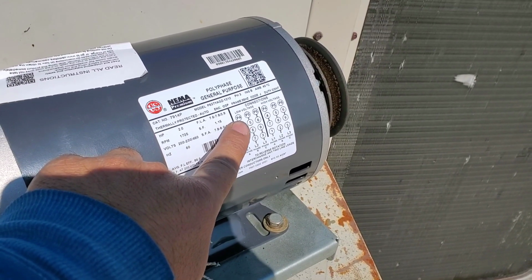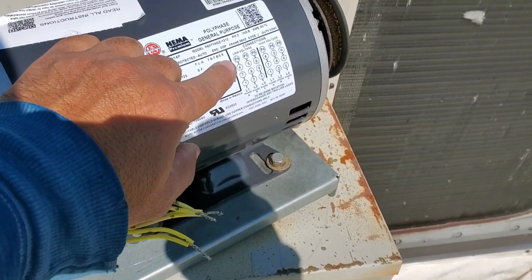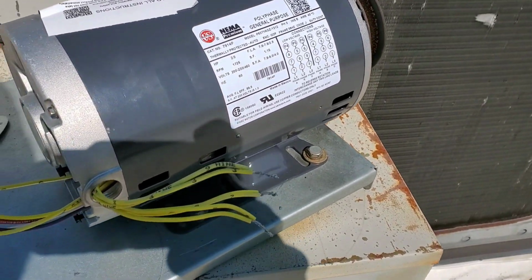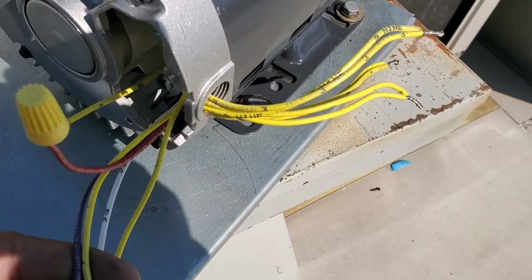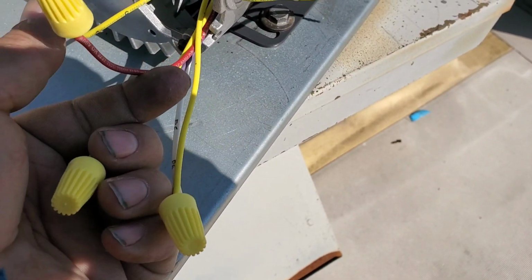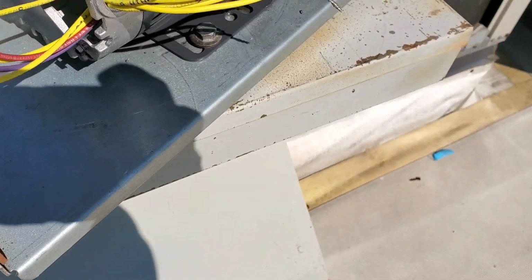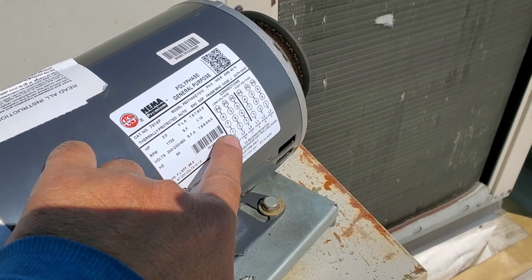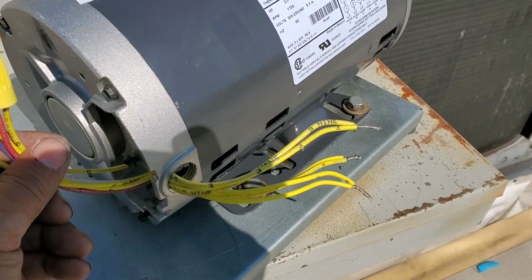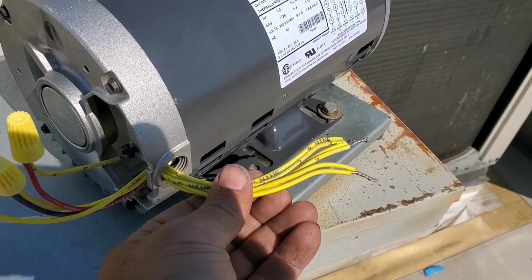So this is the circuit for the low voltage here. They have a total of 12 wires, the winding wires. For example, it says P4 to 4. P4 will connect with 4. They have marked it very well. P4 with 4, same P5 with 5, yes, P5 with 5, like this. And the other three, like 7 to 1, 8 to 2, and 9 to 3, will connect with line 1, 2, and 3. So 4, 5, 6 are all connected together, and this will connect to the line voltage.